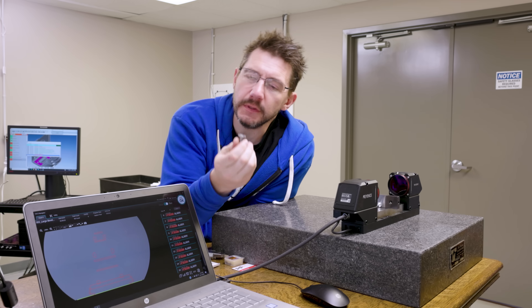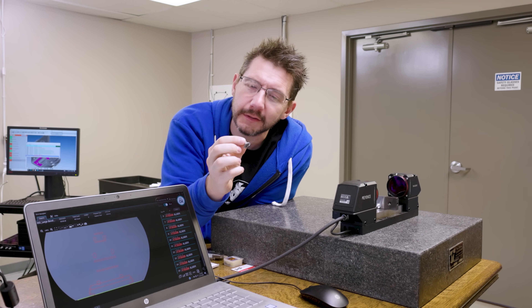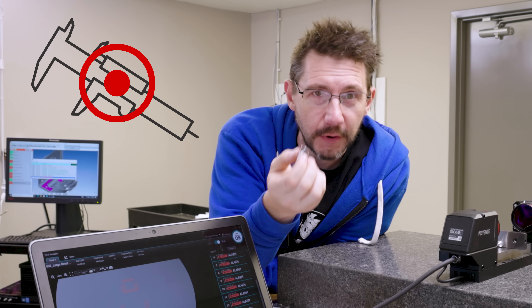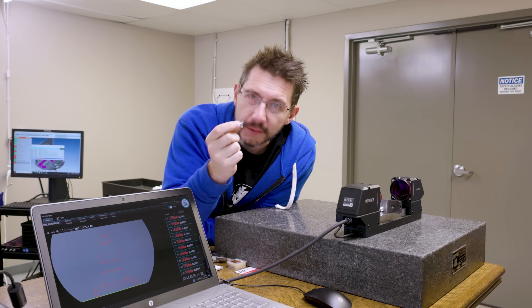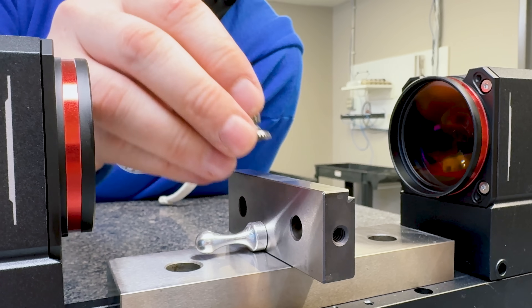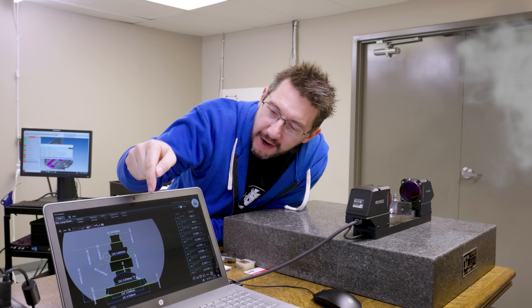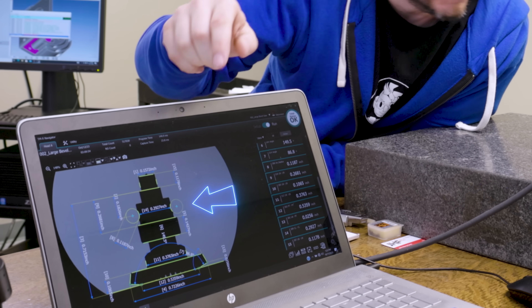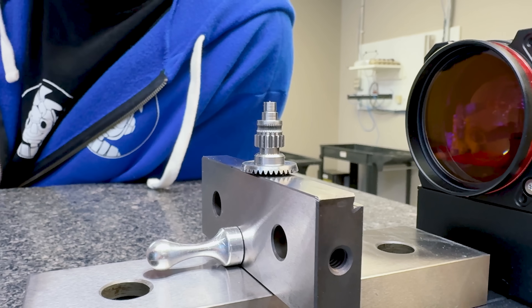Fantastic invention. This is what's responsible for sending the filament down into the hot parts of your 3D printer. But we have to check whether or not this is up to spec. With this piece done, it's now time to inspect it. With this geometry, you would think it would be incredibly difficult — there's no place to really put calipers and get an accurate measurement. And that's where lasers come in. Using lasers, this device is able to take measurements of this tiny little gear to ten thousandths of an inch. This gear has measurements across faces and geometry that no human would be able to do themselves without the assistance of this laser light. This inspects fine. Let's head to the next step.